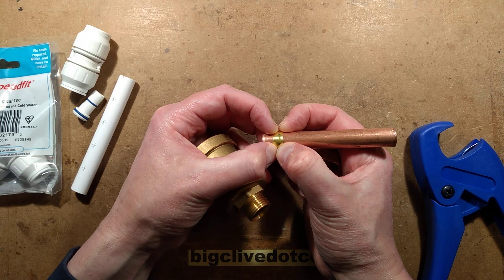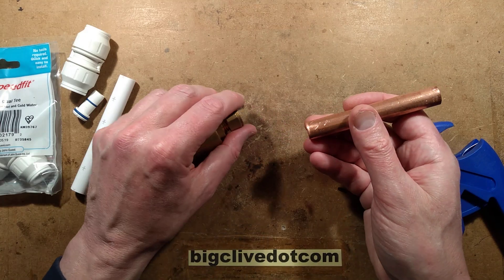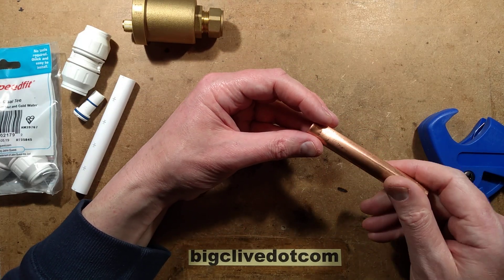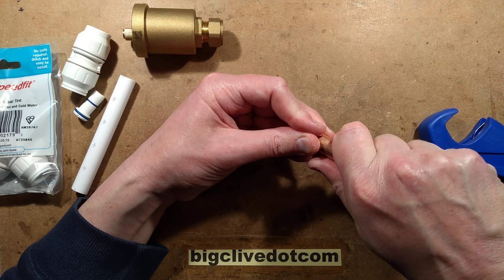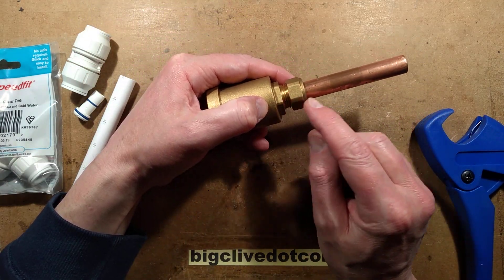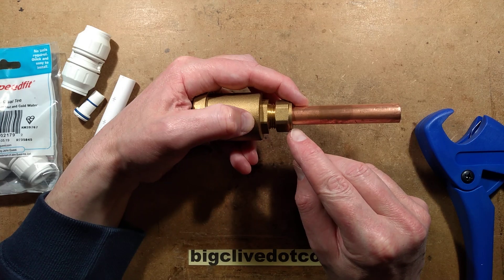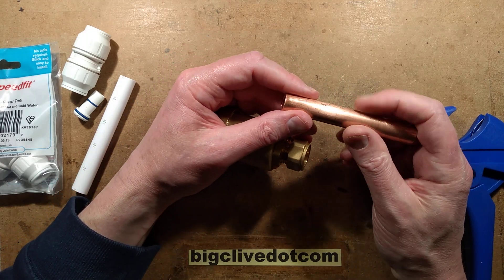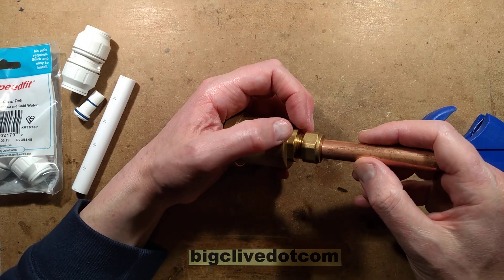An olive is a metal ring that, as you tighten up because of its shape, is crushed — almost crimped — onto the pipe and forms a very tight seal. As long as you use clean copper with no burrs or scuffs in it, it's very good. When I was young and inexperienced I used to clean it in a copper cleaner actually designed for soldering pipes. What I didn't realize was that as you screwed around in it, it grooved it, and more importantly when you pulled out it left lots of lengthways grooves, meaning when you tightened up there were tiny little grooves for water to seep through. I found later it's better to use a very fine abrasive, only spin it around like that and then take it off — not drag it through anything. But that's just learning experience.